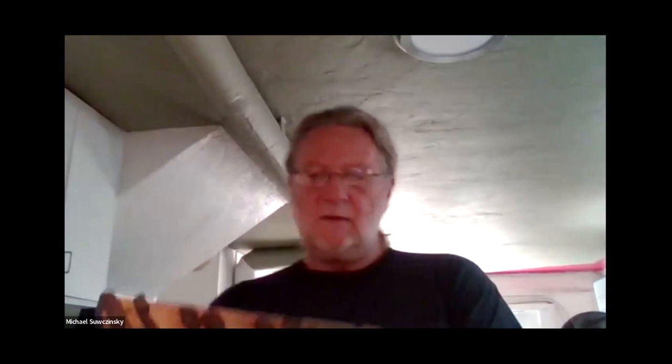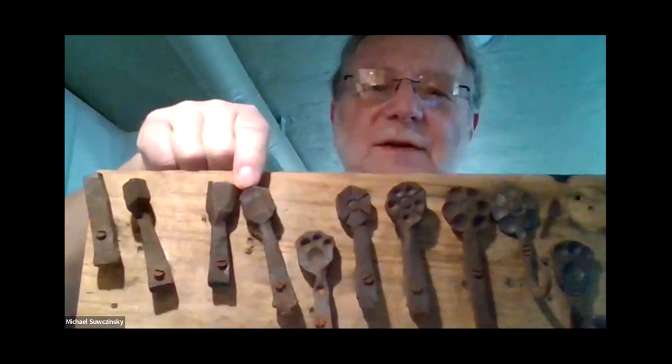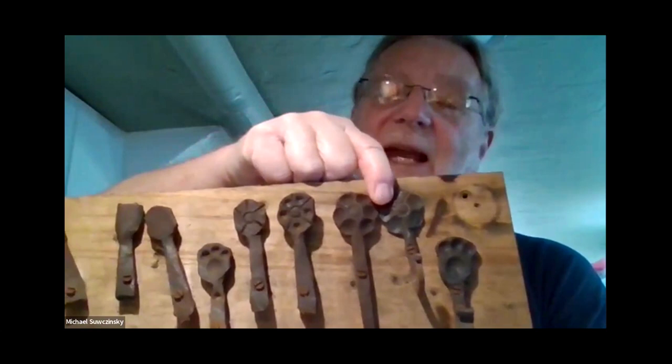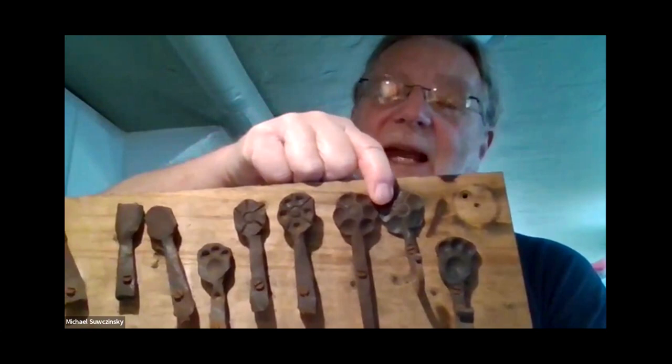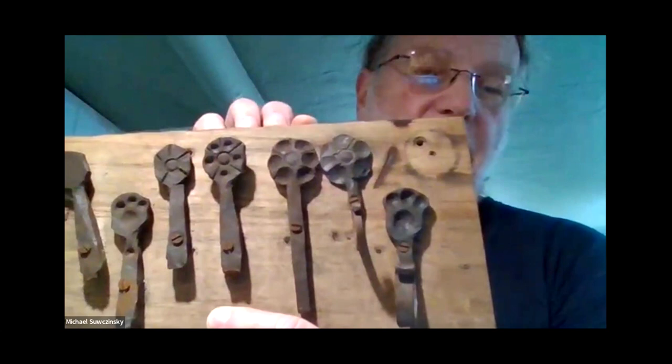I do have a storyboard starting from half-inch square to a double-sided taper, to a squish, to a lozenge of some sort, and then chisel marks, round punch marks, adapted round punch marks, and to the final hook. Something that also works well is that it's very easy to do a paw type of shape, and you end up with a leash hook. I think I may have made more dog paw shaped hooks for leashes than flowers, because I know a lot of people with dogs.